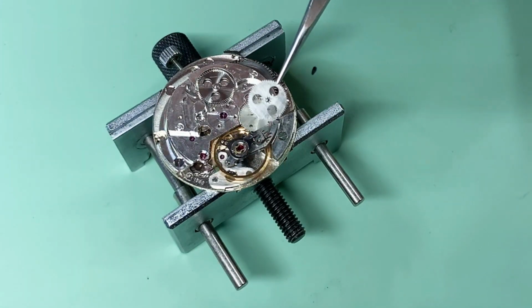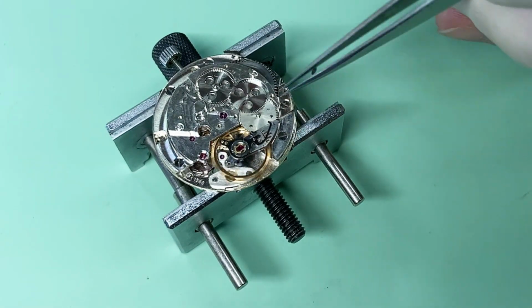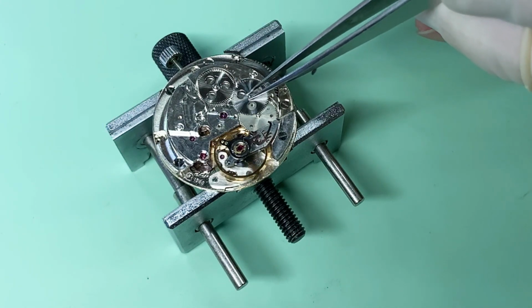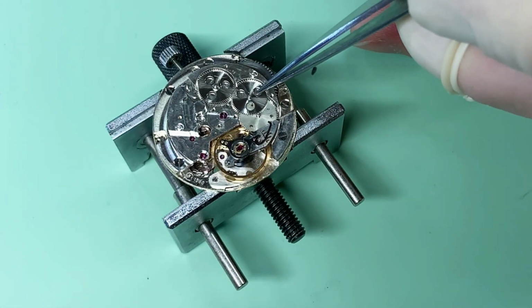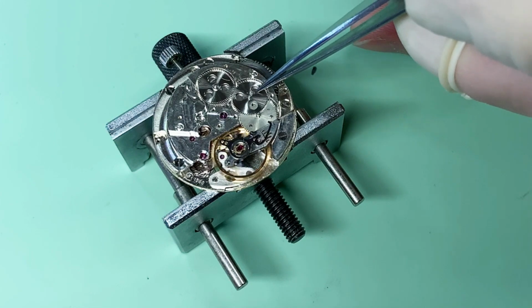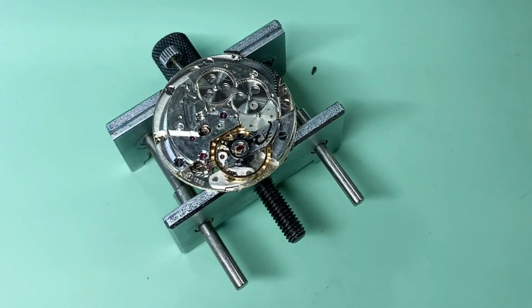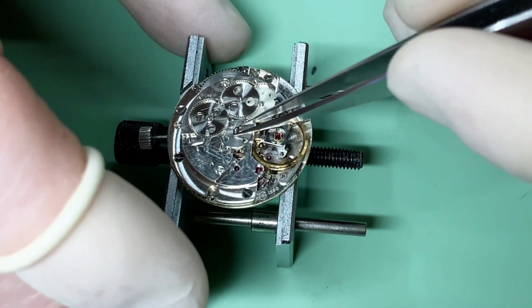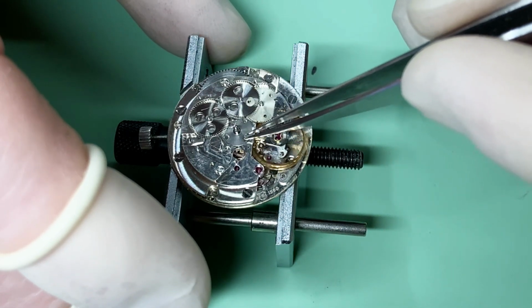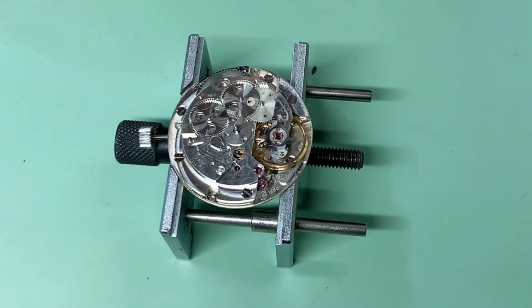And then the last one that's got a little gear on the underside. And that's going to fit in its jewel, which is there. And then hopefully, if I can just sort of nudge these a little bit, you can see everything turning. And then, of course, I forgot, as I keep forgetting lots of things, to put the little cap on, which goes there. So I'll get that in position, and of course I've got three screws, so I'll just do those screws off camera and then we'll come back and we'll try and do that horrible looking spring.